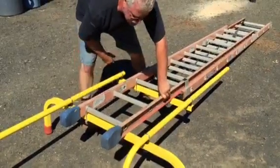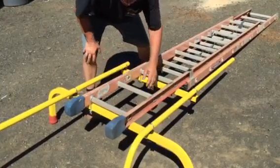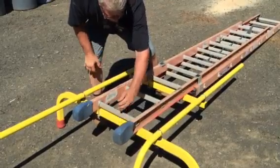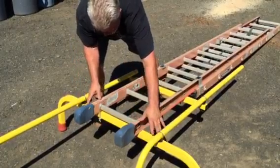All right, guys, this is what happens when you unfold it. This is the position that the arms are in. You want to slide it under your ladder. You want to position your cross brace flush, width equal to your top rung of your ladder and equal distance on the sides. Place your U-bolts down and tighten while it's centrally located on the ladder.